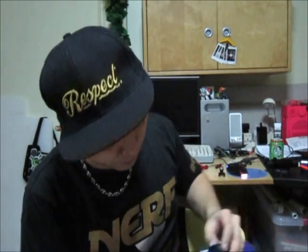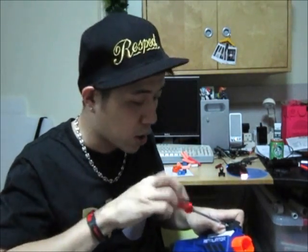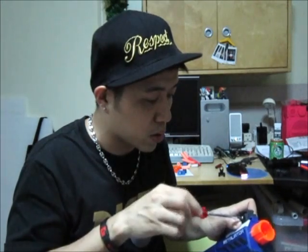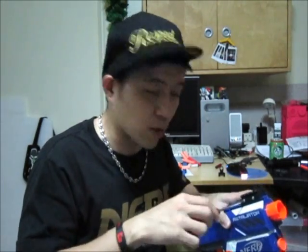Then you get the other piece, line it up just like this, and then you get your Phillips head screwdriver and screw everything in again. One thing for you guys to take note, and I guess Slydev could take note of this too: these are just 3D printed products, so they are not as sturdy as your regular solid plastic. It is made of ABS resin, so please take note, but if you screw it too tight, you would probably drive the screw too deep in, and it would eventually crack or split the plastic. I would actually give you some examples later.